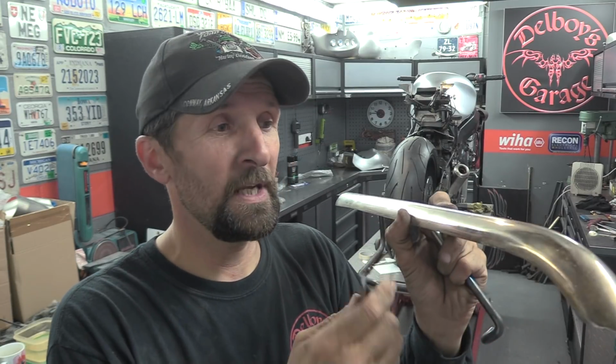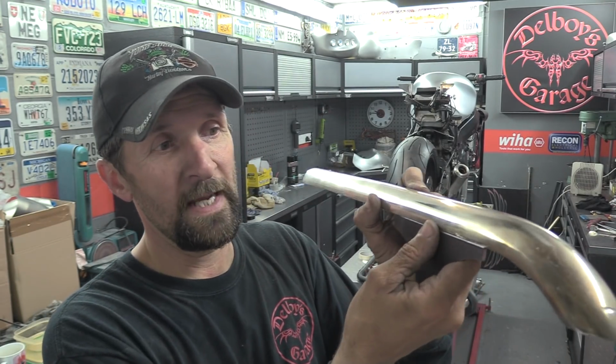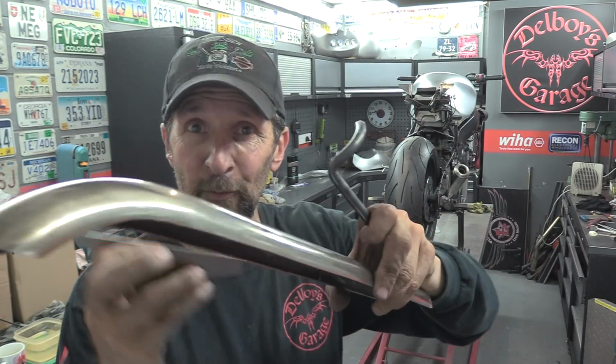Now that is high grade stainless and it's 2mm thick. That is mild and it's 3mm thick. In theory, in extremely rough and ready theory, the weld temperature for those two is similar, because you need hotter for stainless, cooler for mild, and that's thicker so it can take hotter, blah, blah, blah. So that should be fine to weld to that. We shall see. So there's the three main pieces.